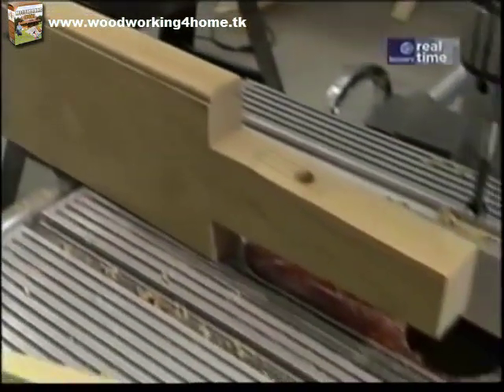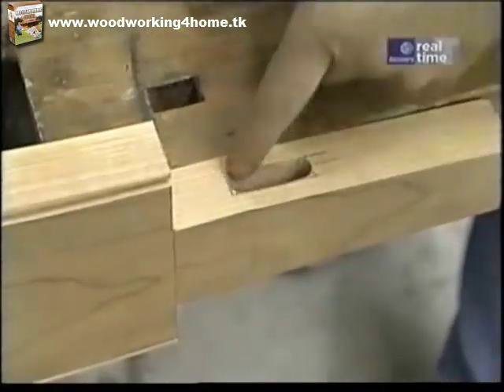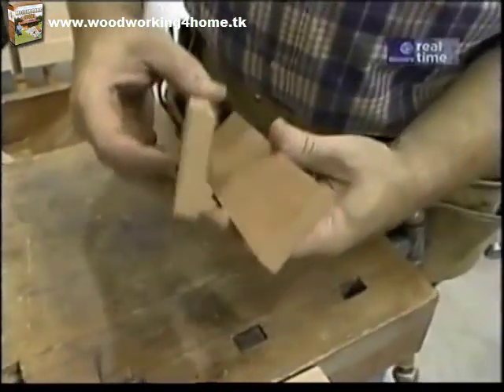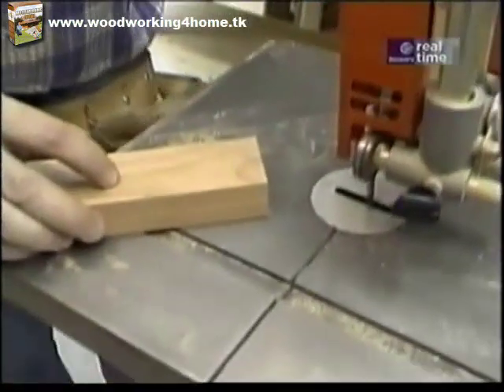The rest of the mortising will take place at just 90 degrees. That cleans up the mortises, and now I'm ready to make the wedges, which are half-inch stock, and I'll just hold a couple pieces together and cut them on the bandsaw.